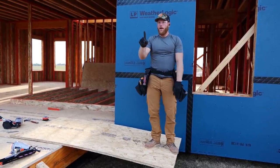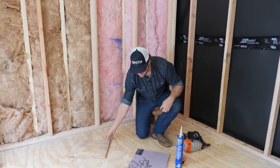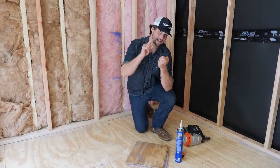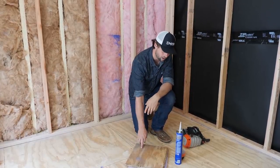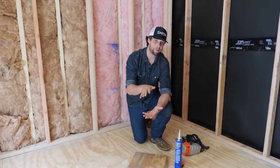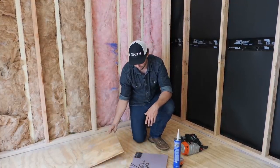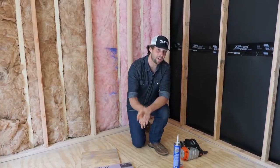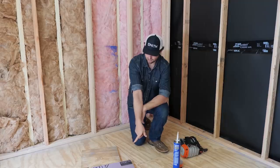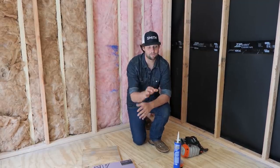This is what we use to attach the subfloor in addition to the glue, and the whole reason we're doing it this way is we are doing two things. We are damping the sound as it comes through — it has to go from one media to another media to another media, and it burns up that sound energy as heat. And then more importantly, we are decoupling, making the shaking from the bottom shake less up at the top. This isn't a perfect decoupling by any stretch — it would be much better to have an air gap underneath there because air is a much better spring and it's going to transfer much less energy. However, doing a complete floor on top of a floor with an air gap would take way too much space out of this room.